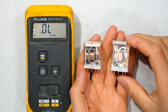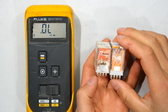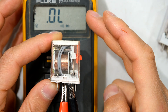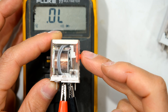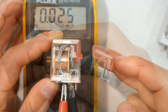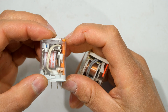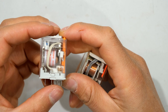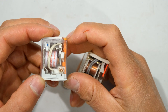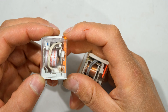It's sometimes useful if the relay has a test facility. Both these relays have a test button — you can operate the relay manually without applying any current to the coil. With my multimeter set to continuity, watch what happens when I push the test button: you can hear it is now a short circuit. Some relays have a test button on top — when I depress this pin, it operates the relay. This is useful in troubleshooting when it's difficult to apply the voltage but you still want to test whether the load would operate correctly if the relay were in working condition.